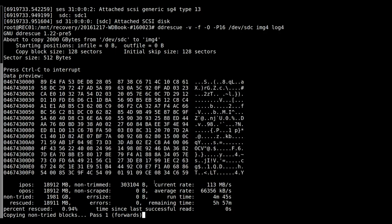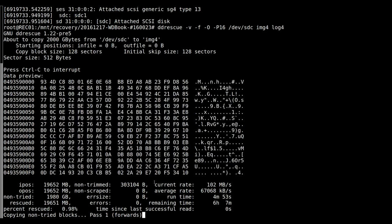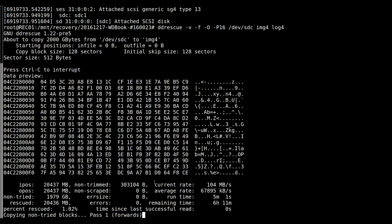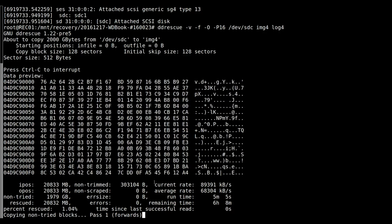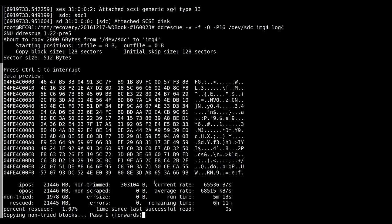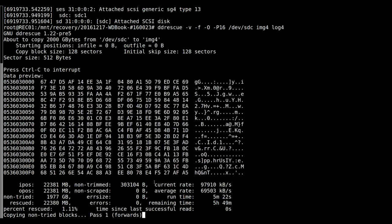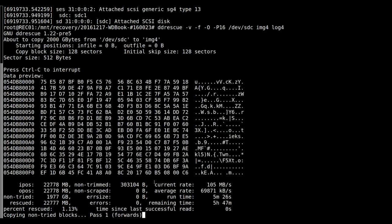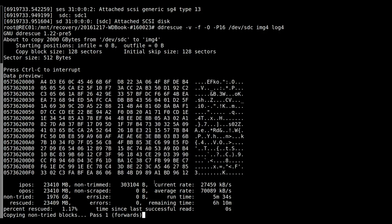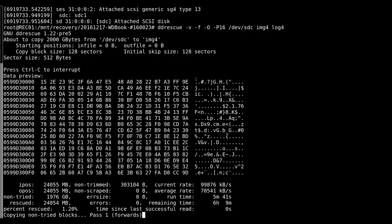I'm really curious as to why I'm not seeing any meaningful file signatures yet in this. I mean, I know it's only 20 gigs in roughly, but I should be seeing something. And I know it must be reading decrypted because we were able to mount the drive. I wonder if I've got to read it as the partition itself. That is to say, maybe the controller doesn't understand raw requests. Maybe it wants to have requests directly from SDC1. I'm just going to stop this and try that, because this isn't giving me a lot of confidence right now.